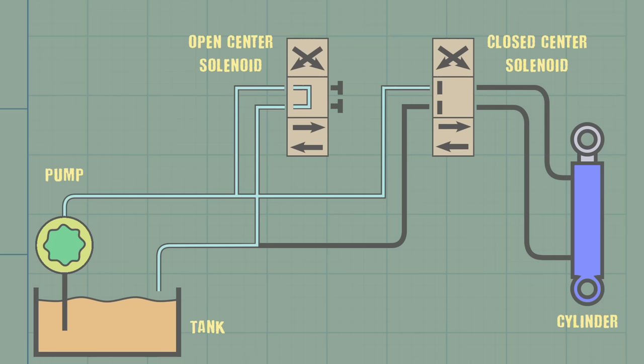You may remember from high school physics class that kinetic friction is lower than static friction. That means that it takes less force to keep something moving than it does to get something moving. And that difference is the primary culprit here. This is a universal problem, and it's especially annoying when we want to make very precise movements over a small distance. It's sometimes called stiction or slip stick.